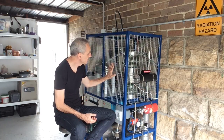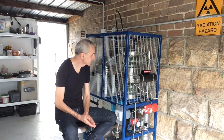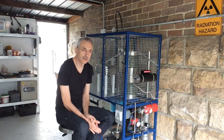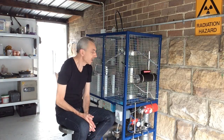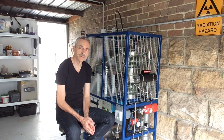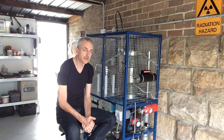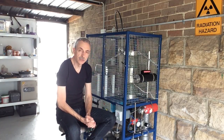One problem I had was with the vacuum chamber, which is essentially my own design. It's constructed from glass discs glued together with aluminium discs using latex glue, and it worked really well. It held vacuum, but we had a small leak — leaking about 2 microns a second. After a while we decided to flow some latex glue in between the discs. I pumped down the chamber and painted latex glue around all the seams, and it worked really well.